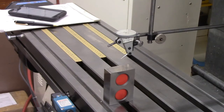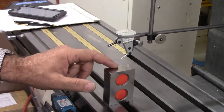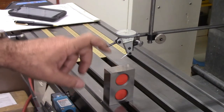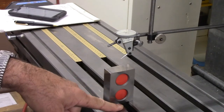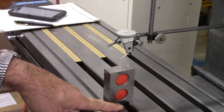Okay guys, this is how I'm going to do the Z-axis so I don't introduce any backlash. I'm going to come down to the top of this block — I verified it is exactly three inches with my height gauge. Touch off on it to zero, then move the block out of the way, come down to the table until it's zero, and get our calculations from there.